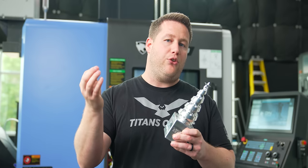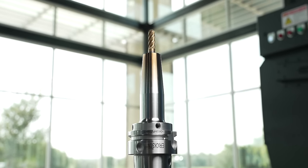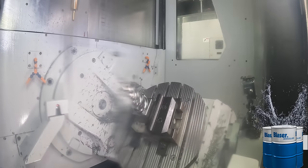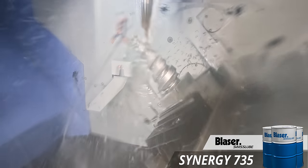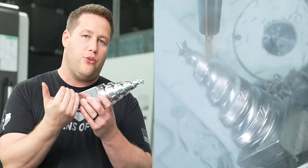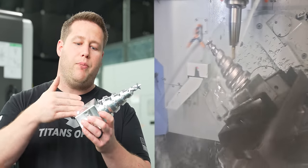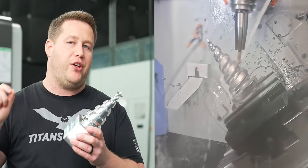The next tool is our finishing ball nose — a six-flute ball — and we're going to start finishing the OD. When surface milling with a ball nose, not only do you want to get off the tip, you also want to be at a steep enough angle to engage all of the flutes, because not all flutes go to the center of the tool. Typically only one or possibly two flutes go to center, so we want to be at a steep enough angle to engage all six flutes of this tool.